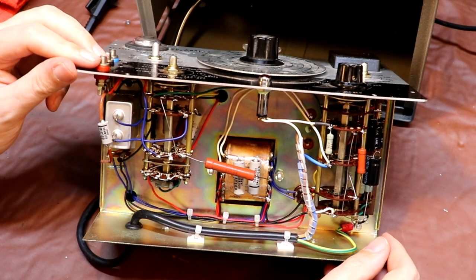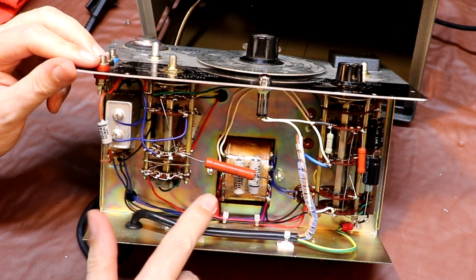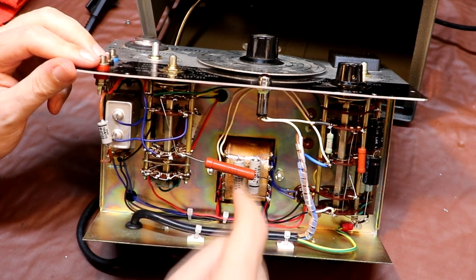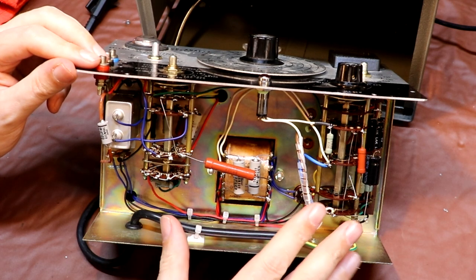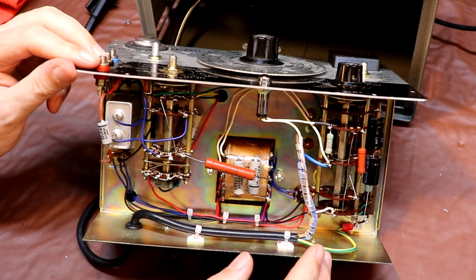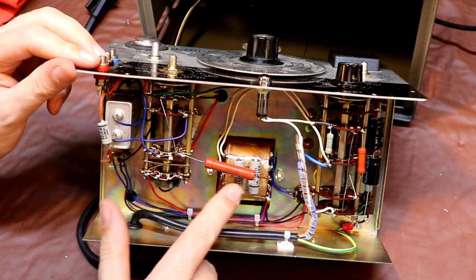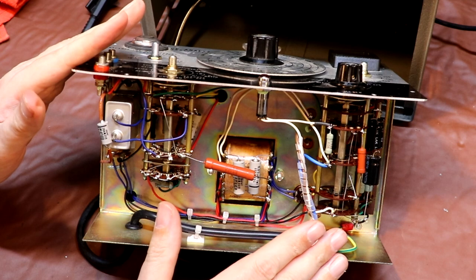I'm sorry about that, but I did become just a little bit stuck trying to deal with these capacitors here. As I explained last time, one of these capacitors — this one here — is actually wired between the live terminal, the primary of the transformer which has 230 volts live on it, and it's wired to the actual chassis via this black wire, which goes to chassis.